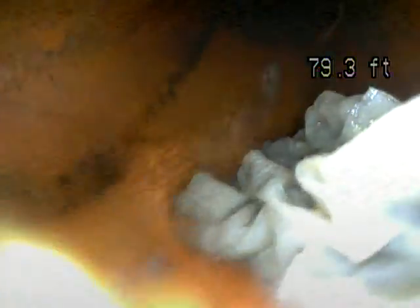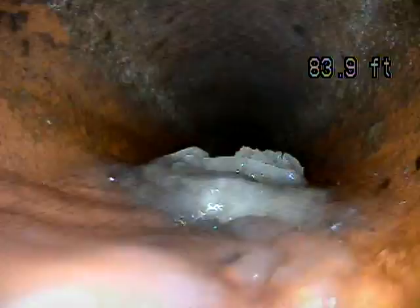I'm going to flush another toilet to see if I can flush that down. The good news is we're going to be able to see a lot more of the line than if I wasn't able to get past that root. The bad news is that you do have some standing water, and at a minimum you need to have this cleaned out. That wipe washed down the line — you always want to avoid wet wipes. Even if it says they're flushable, I would avoid them. There's that wipe again — that's not toilet paper, that's a wet wipe.